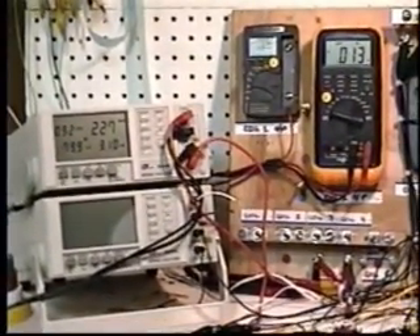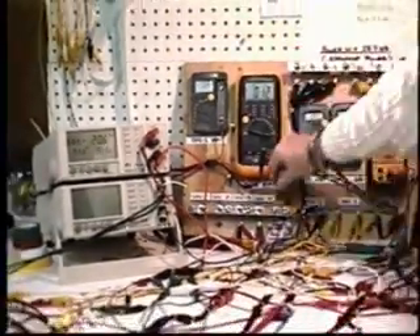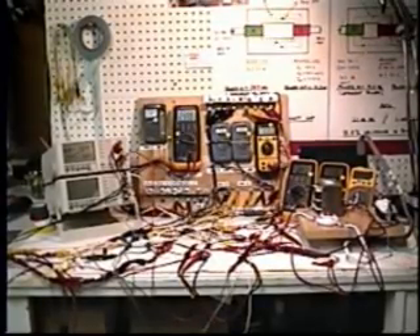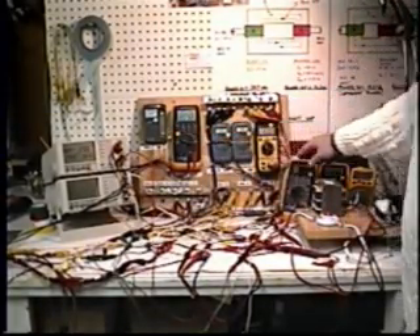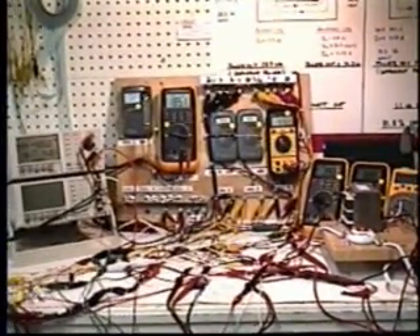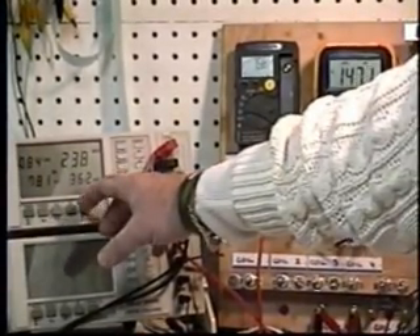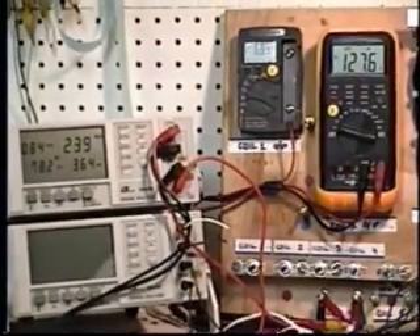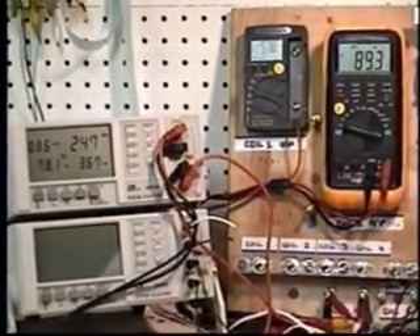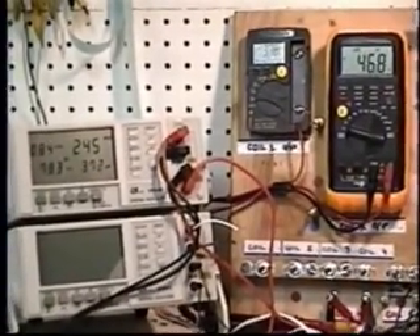Our input to our motor is 80.1 volts. I have the rear stack set. I'm going to disconnect all the coils. As you can see, the normal voltages coming from our generator are dropping, the power going through the motor is increasing, and the system is slowing down. Right now, we are running the system on the induction motor alone.